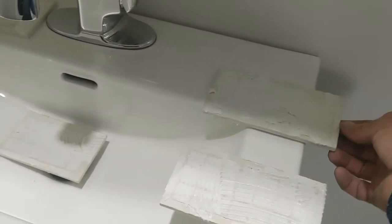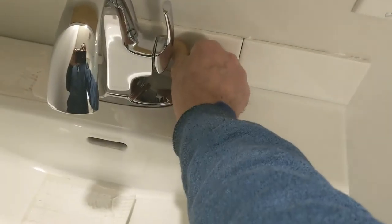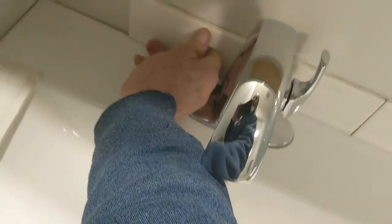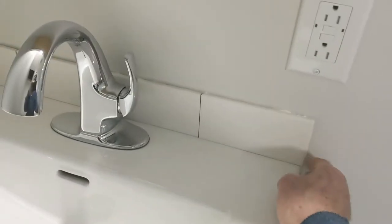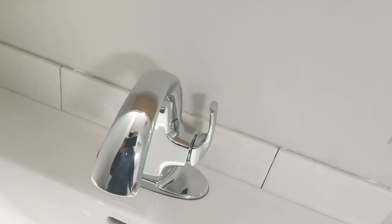So guys I have the tiles all with the glue on, all I have to do is put them on the wall, nice and easy. The first one just goes straight with the counter top, put it in there, push it hard to get it tight. Then I have the next one, let's go in there again, push it hard. Like you guys can see, this guy already has a little space there for the grout. Doesn't take long at all, few minutes. The last one would be this one on the corner, straight on the corner here. Then the same way I do it with the side one, the small piece goes on the corner.